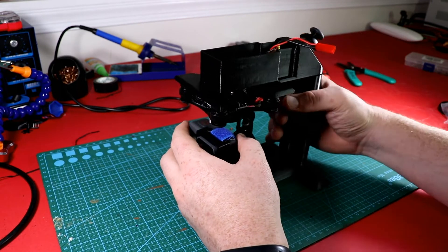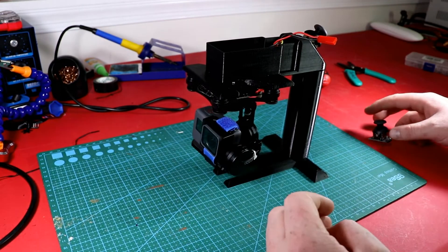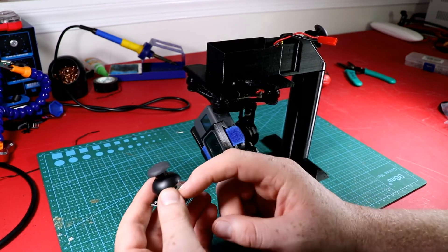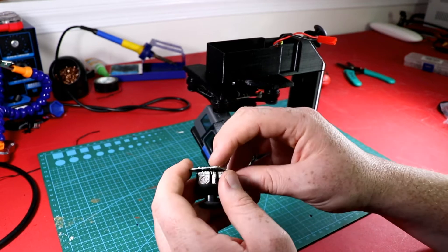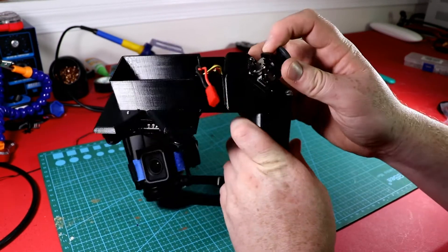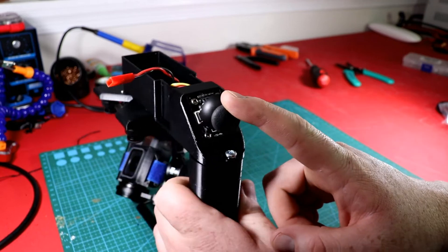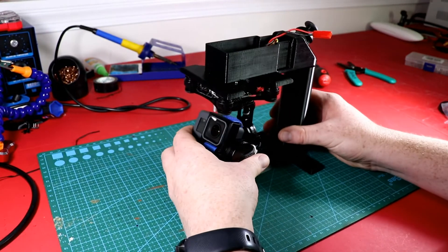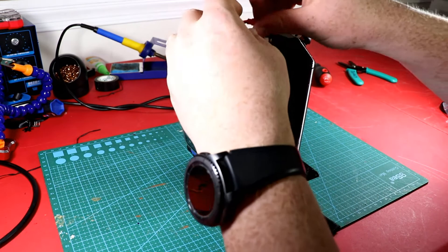I already calibrated and tested it out a little bit. I want to mention that I did desolder the pins and put them pointing down, but I think I held the soldering iron on too long and the joystick stopped working. I took another one from the 5-pack, clipped the top pins, soldered the wires underneath, and added a little hot glue — and it's working now. Plugging it in and waiting for it to fully calibrate and configure itself. That beeping means it's configured.